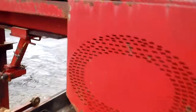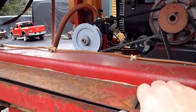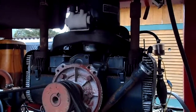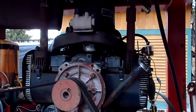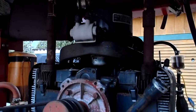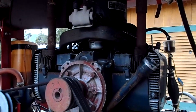When I first got it I had to replace the bearings, and I put a new V-belt pulley on the hydraulic motor. I also put a new coil on there — it would start cold and run pretty good, then start missing and running poorly, and when you shut it off when it got hot you couldn't get it started again. One side of the coil was going bad. I replaced the coil and it runs pretty good now.